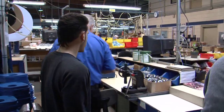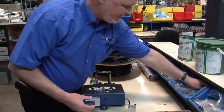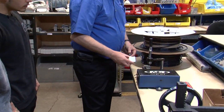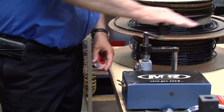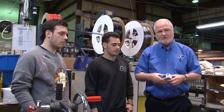We even make our own cylinders. This is the chopper — the cylinder that locks your squeegees and flood bars. We bring in the extrusions, and there's a spring, a cap, and a piston. We design our own tools to make the parts. Operators open these up, drop in the piston, hit the lock, throw the cap on — and a typical operator making these cylinders has to make approximately 400 per day in order to keep up with normal production.